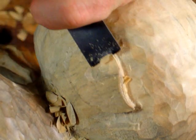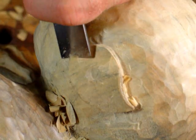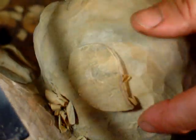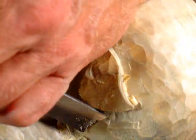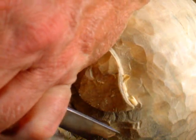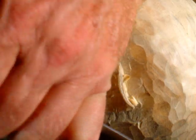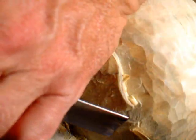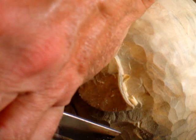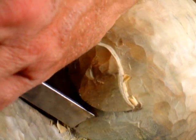It will emerge from the side of the head at the beginning, and then I will continue to work the back of the head back. There's some of that roughness — that was telling me, in fact on the other side was where I busted out that chip in the other video. But that roughness is telling me it does not like the direction that I'm going. Straight back is what the grain seems to want.